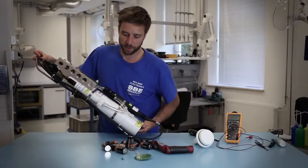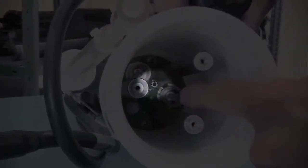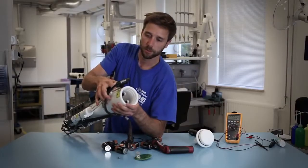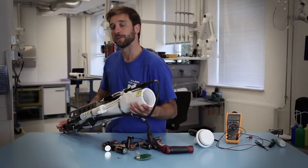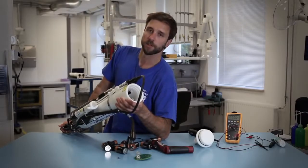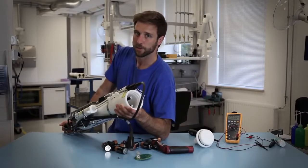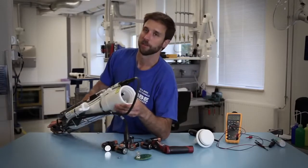You can also see inside the battery compartment the reset switch for the CTD. The reset switch is located at the very bottom, and when you depress that button it's going to remove the power to the CPU board on the CTD. That's going to reset the circuitry in case the CTD has become corrupted into a certain state. You'll just hold that button down for a couple of seconds, lift it up, and reinstall the batteries.